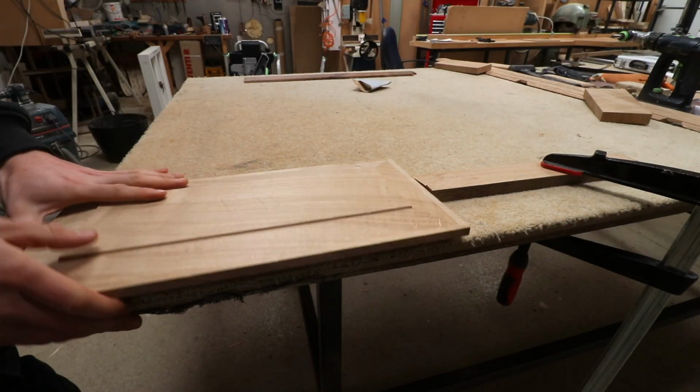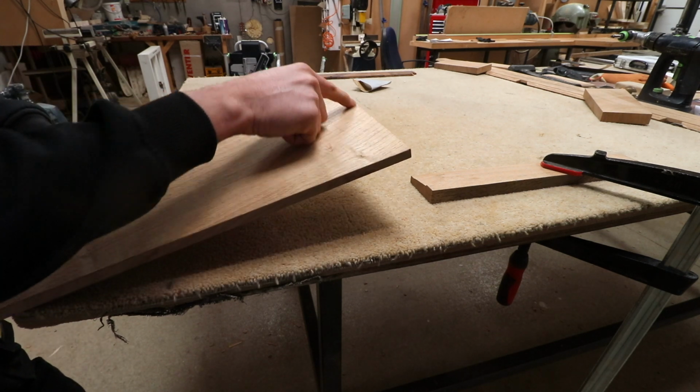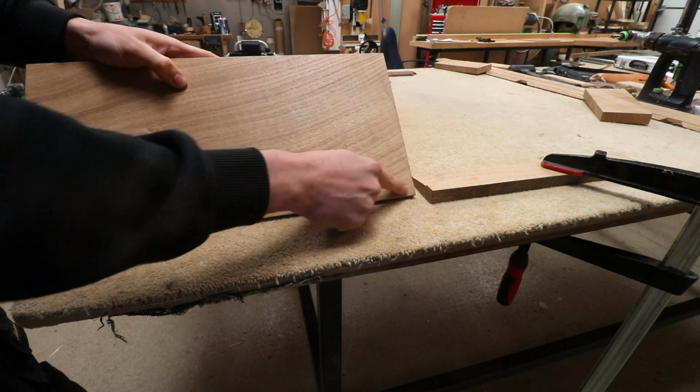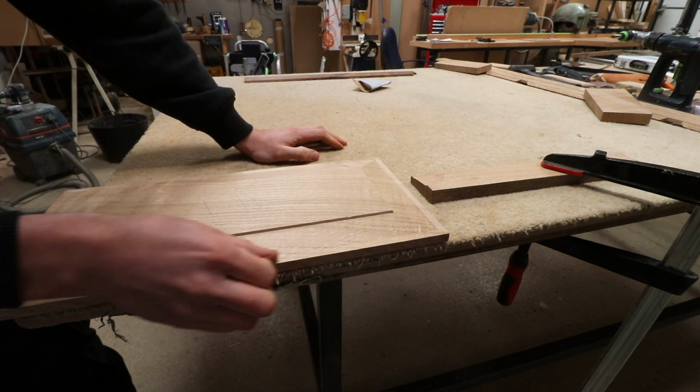Now we just need to sand the panels. We can do the backs of them with the orbital sander. I don't want to take too much off around the edges with the higher grits because I want to keep that fit. It's a very light sand around the edges on the back. We don't need to sand anything off this fit edge on the front where it's parallel.